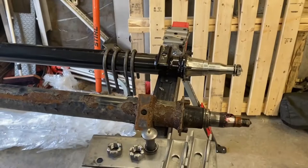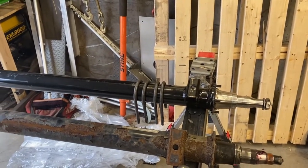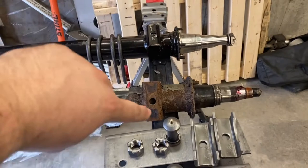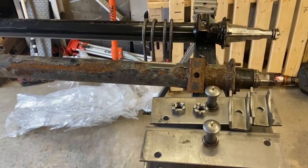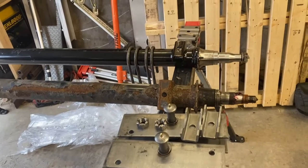The flange distance is a little bit different, which I'm not sure why, because it's the longest axle that I could get, and it's a smidge short, but we'll see what happens when it goes into place, and then we will have to relocate the perches. These are 79 on center, and those are 80 on center. It was kind of an oddball axle when I went and purchased it to find it. So I got the right hub distance and then just have to re-weld the perches.